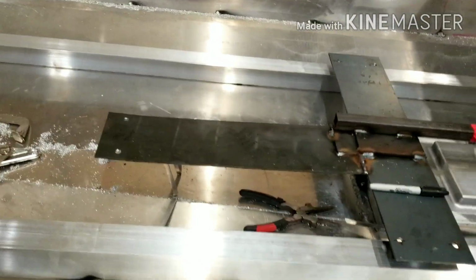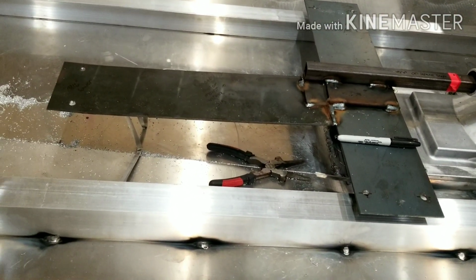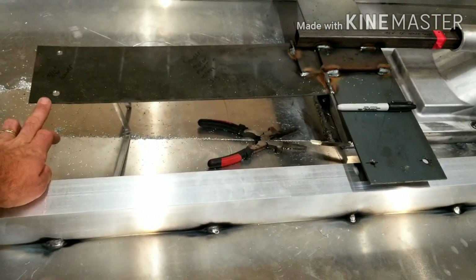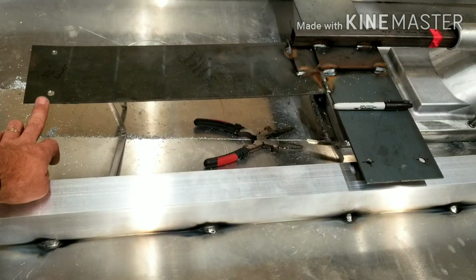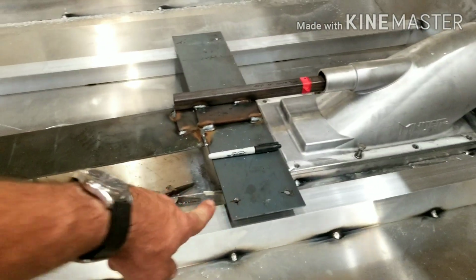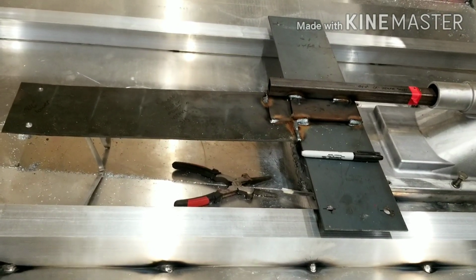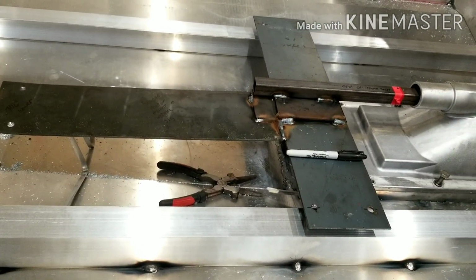And if you watched the second video where we were tearing this down and building this jig, you remember this motor mount here in the front of the motor is actually 3/16 of an inch lower than the back sides. So this is just getting stuff mocked up, not fully welding, nothing yet. So